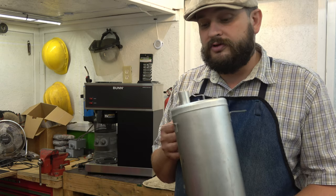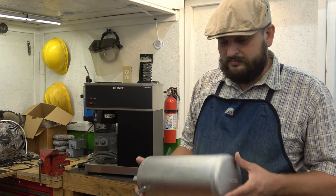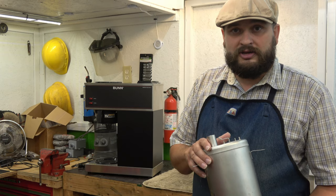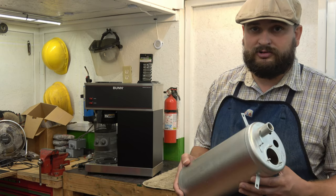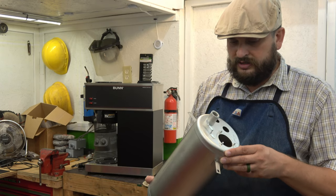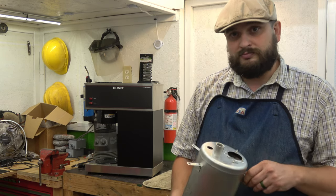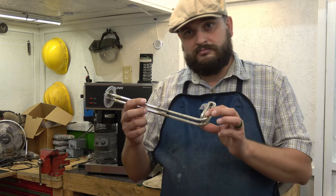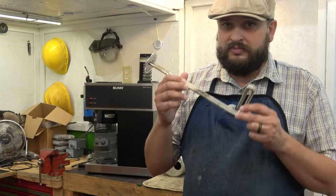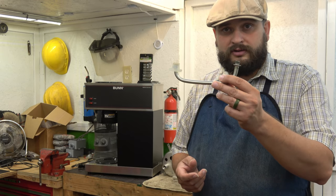He said the water that came out wasn't that warm — because he was filling it up and it didn't have time to heat up. The end result: the tank is busted, no good. It's so full of scale that I couldn't clean it — it's a sealed tank and I tried all kinds of ways. Once it started scaling up the wells inside, that was it. Better to get another tank. The element was also iffy, so I got a new tank, new element, and due to the scale buildup, a new tube as well.